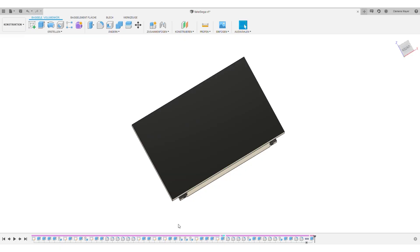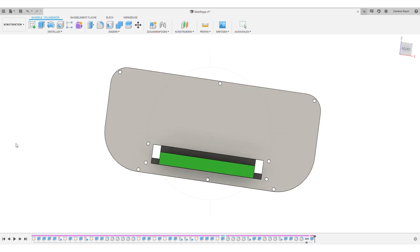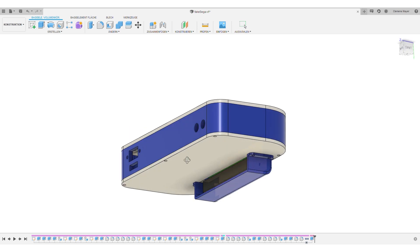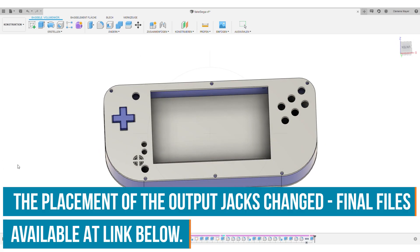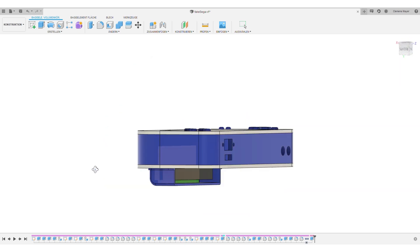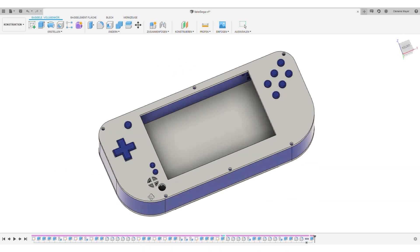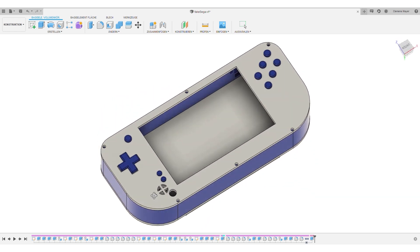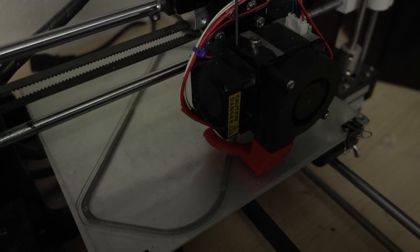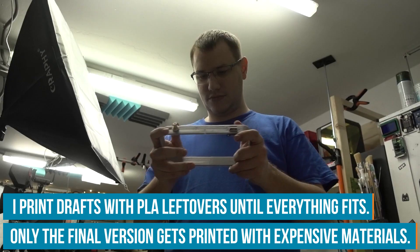When thinking about how to connect everything I drew up a design in Fusion 360 for the case to make sure everything fits — representations of the screen, the main board and other components. I gave extra wiggle room for the cables since there will be a lot of them. The unit has a sandwich construction: a front plate, a rim, a back plate, and a little back piece covering the cartridge slot. I designed it in landscape orientation to make it look like a Game Gear or the Sega Nomad, and because the big screen would be awkward to hold in portrait like a Game Boy.